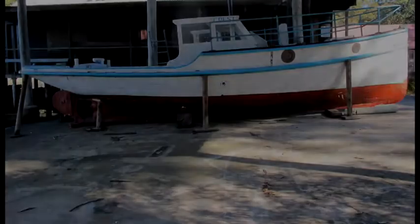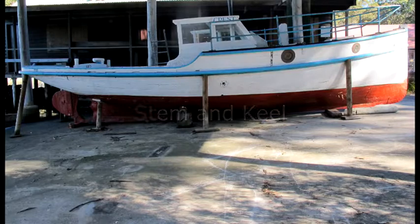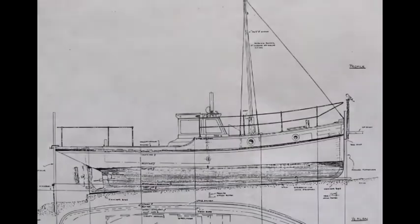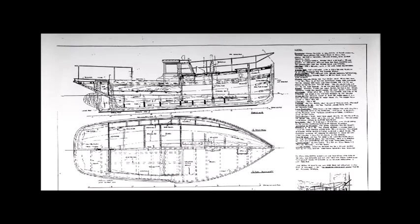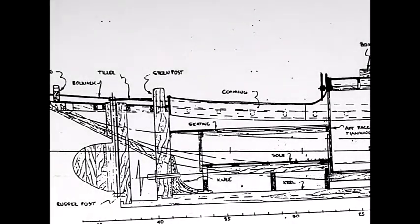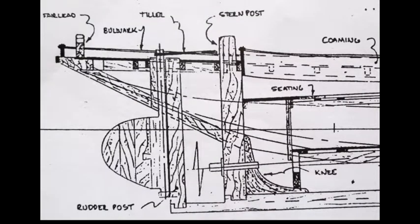In this video we're looking at the restoration of the stem and the keel of the Crest in wood boat construction. The keel is the basic foundation or spine of the hull and is the major source of structural strength. The Crest keel is made of two overlapping or scarfed lengths of timber, with the aft piece supporting the stern post and the rudder post.